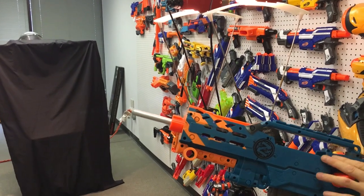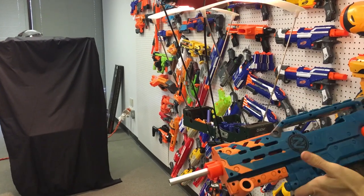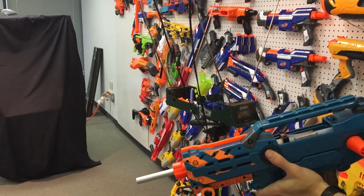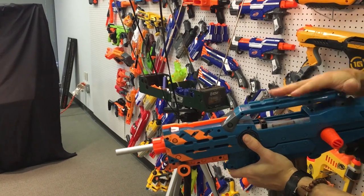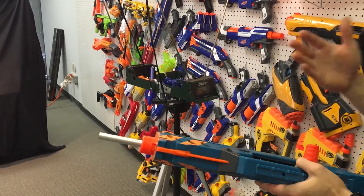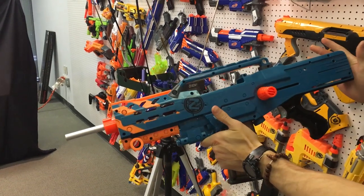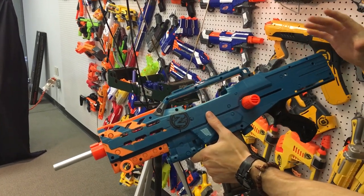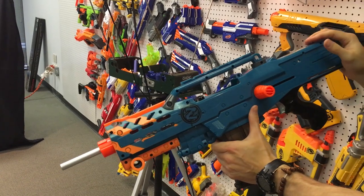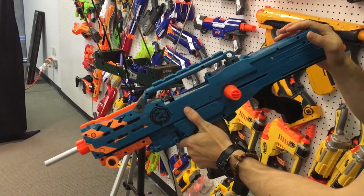And that's a wrap. So there you have it — 3D printed components with the expanded aluminum plunger body and barrel. The end user can experiment with barrel lengths and spring weights, but that's about what you can expect performance-wise with a 20 kilogram spring. A sloppily sealed blaster should be hitting around 220 to 250. As you saw, the seal on this one is exceptional and we were getting velocities just shy of 280. With the 14 kilogram spring, use a slightly shorter barrel and you'll be just below 200 — if you want something that fires faster, go 14 kg; for max power, go with the 20. Thanks for watching.